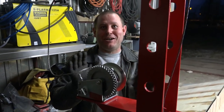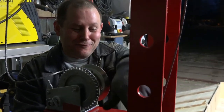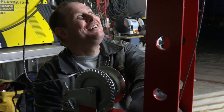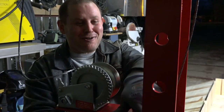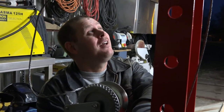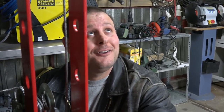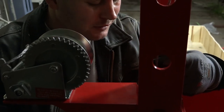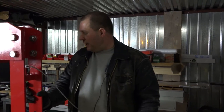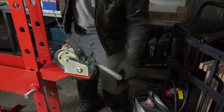I think I'm not alone in the world with this — when we work with the hand in very tight areas, we always do like this: we start to work with the hand and then we always watch in a totally different direction. So, this is one professional feature. Because what you can find on the market for 400 to 500 euro, you will not get this — which is a pulley system. Now your bridge alone is like 15 kilograms. The part holder and special tool set is another 5 kilograms. And your part can be easily up to 10 kilograms. On the average hydraulic presses you can buy on eBay for 400-500 euro, you have to work with your hand, and if you are alone you cannot do this alone because you can only lift one side.